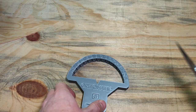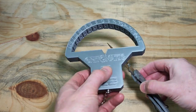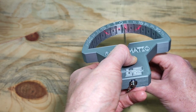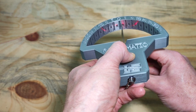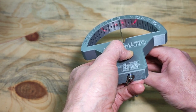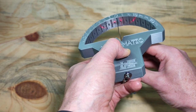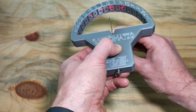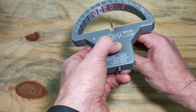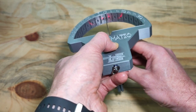Let's have a look at a knife that has a slightly more hazy, coarse finished edge instead of a polished edge like the first one. Turn on the laser, put the knife right in the center in the V, center all the dots, and you can see pretty much right on just above 2.5 degrees primary angle for the edge grind. Outside of that you see two hazy lines, because of the slightly coarse edge finish on this knife. Both sides are approximately 13 to 14 degrees sharpening angle and a 2.5 to 3 degree primary edge grind.